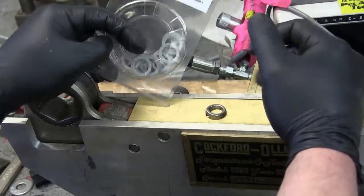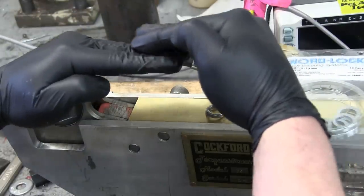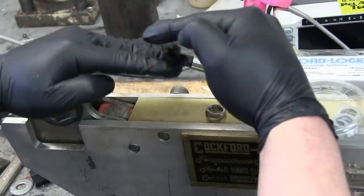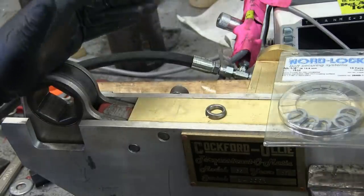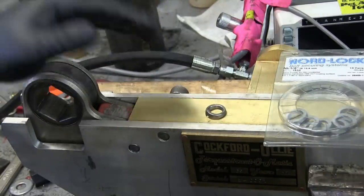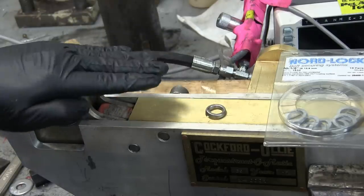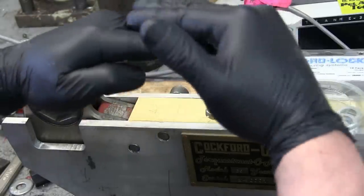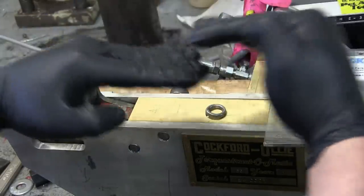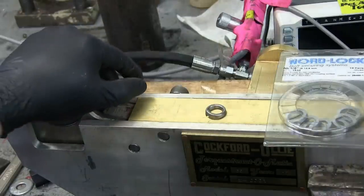The how? There's a Junker test. Basically, you take two plates — one is free to move — and you oscillate it, vibrate it at 12 hertz, or 40 hertz, or whatever hertz you want. It's got a hell of a lot of force, like a ton and a half of force, and it's two plates with a bolted connection. You vibrate them and see how quick it takes for the thing to loosen off.